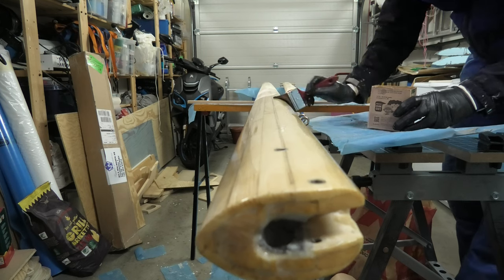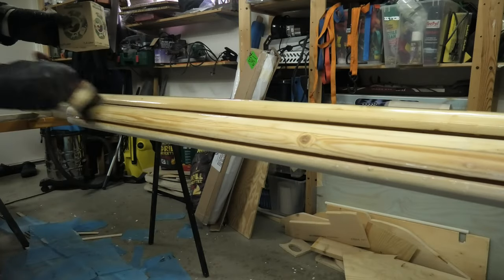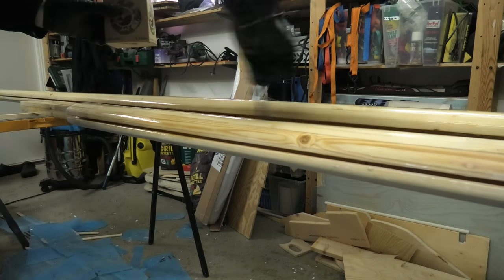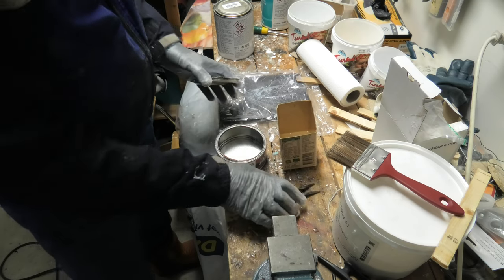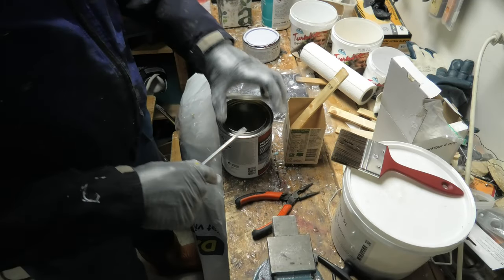As this is the first coat, I prioritize high penetration and start right on. The sail will slip easier on a varnish surface than on epoxy. Thus, I put some varnish in the rope channel. As I wipe the lid, it's still possible to open the can for the second coat. And no problem opening the base.